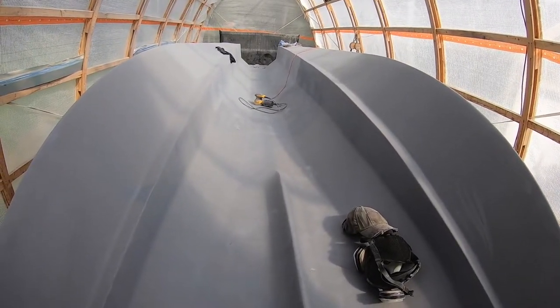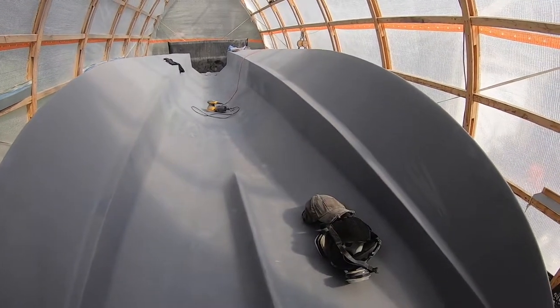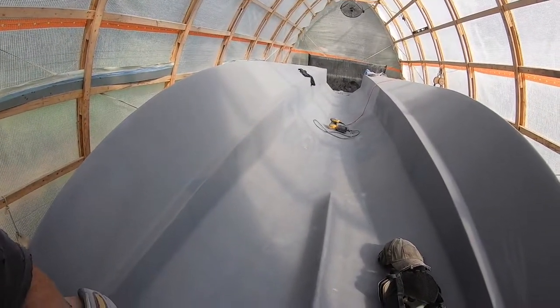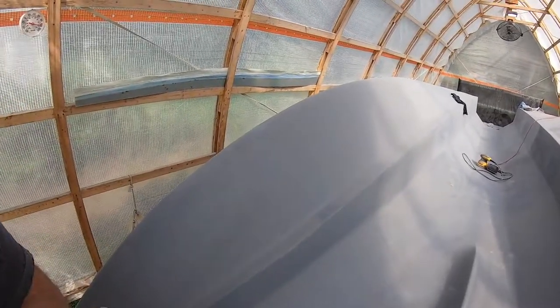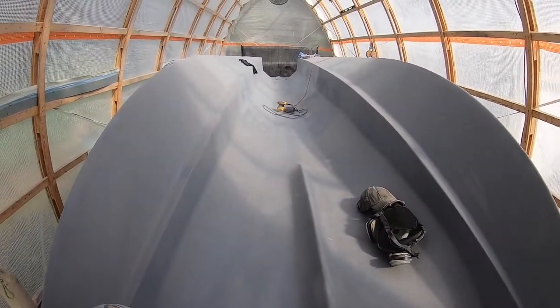We're also looking into going with an HVLP spray system for future painting. The roller gives a very textured orange peel finish as opposed to a spray gun, so we're going to bite the bullet and buy the setup — it'll make life a little bit easier in that realm too. That's kind of where we stand on everything. The product has been good for the most part aside from not letting it cure long enough. Thanks for watching — I'm going to get back to it and try to get this done before it gets too hot in here.